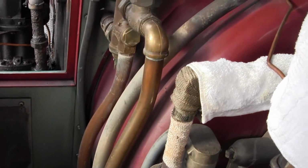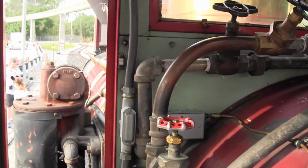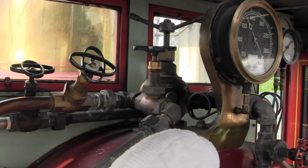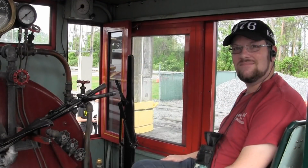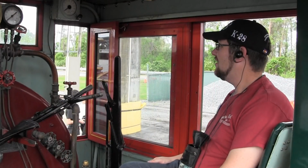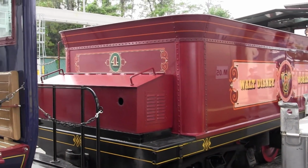Yes. And right now it's essentially a neutral, and all it does, it controls the timing of that slide valve that's inside the steam chest. Yeah. If you move it anywhere forward of center, you can engage forward motion, and there's various degrees. If you move it anywhere rear of center, you can engage reverse motion, and again, varies. That's really water treatment chemical. Yeah.